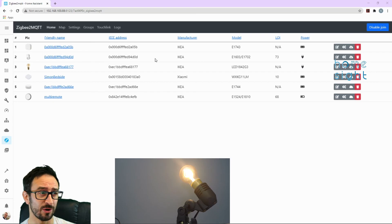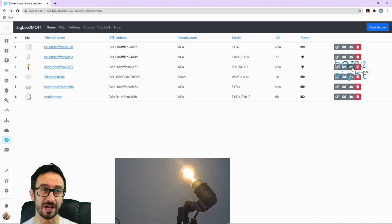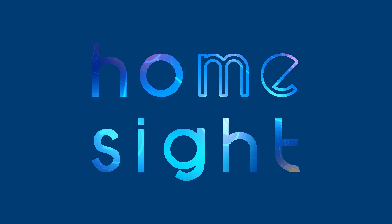We can now go through and rename all the devices. I don't quite know where I'm going to use all of these devices yet, but I'm sure we'll find somewhere. Some of those devices have got a different icon which means there's an update available, but I'm not going to do that just yet. We've taken our IKEA devices that should work with a Tradfri gateway, added them into Home Assistant with our CC2531 made by iTeed. The next steps are to configure them in configuration.yaml and then have a play with them in Node-RED — but that'll be in the next video. Make sure you like and subscribe so you don't miss out!